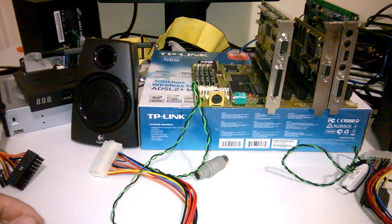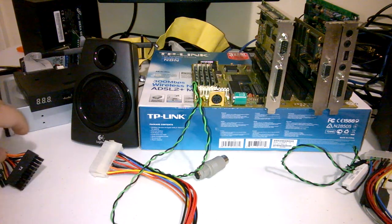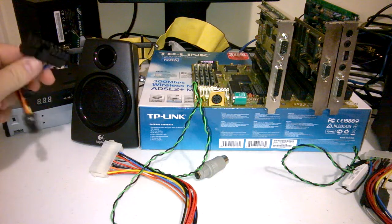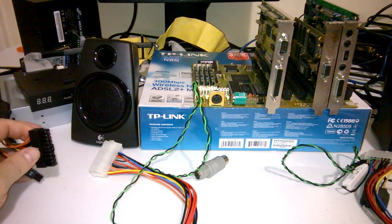I know a lot of people that went through exactly that experience. So I like to use a modern ATX power supply. I've got one over here — it's a 500W FSP power supply. And this is the AT power adapter. The problem is they're not compatible, so you need some form of an adapter.